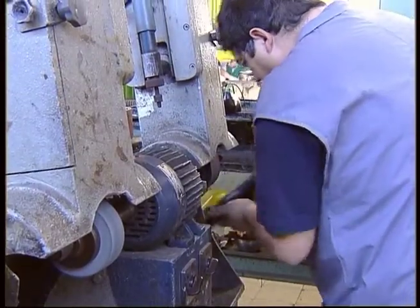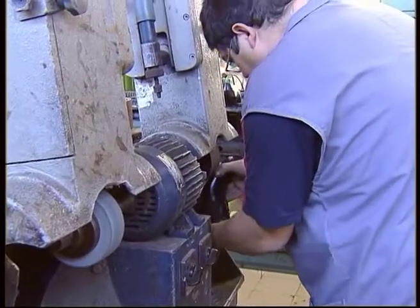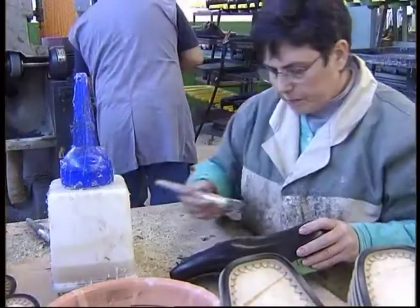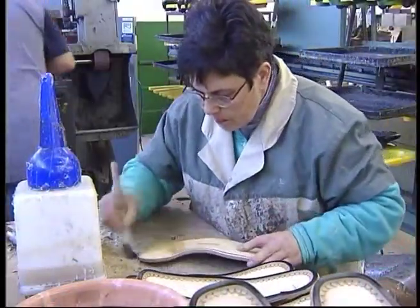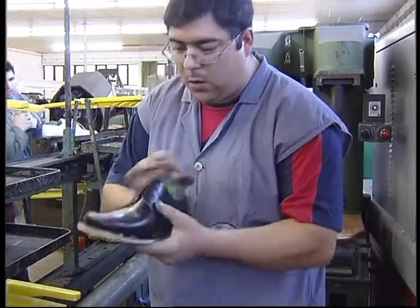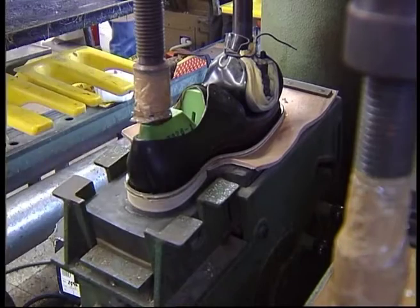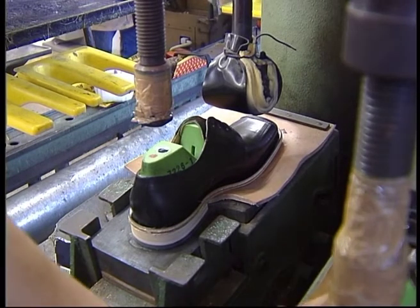To rough the assembly base. After the execution of the operations of closing the upper on the inner sole, it is necessary to prepare the upper for cementing the sole. Usually this operation is made in fluffing machines and shoe bottom roughing machines. To apply glue to the assembly base and to the sole: this operation consists in the application of glue on the surfaces to be joined. To cement the sole to the upper: the sole is pointed manually to the upper and later the shoe is placed in a press to execute the pressing of the sole to the upper. In the case of the Blake stitch, these three operations are relevant to the sequence, allowing removal of the last and handling of the shoe for stitching without moving the sole.